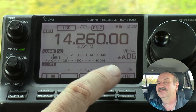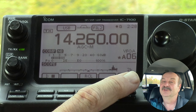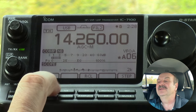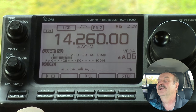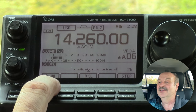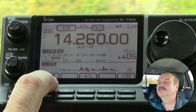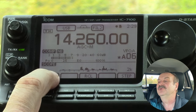At 2kHz you might miss some things in between, although a sideband signal is up to 3kHz wide, so you'll probably get most of the signals. But it's an instant in time, and you can see how dramatically different this display is on each of these sweeps. Because if somebody's mid-syllable while they're talking, you're going to see no signal strength. And then if they're saying a word, you'll see something. And of course, if somebody's calling CQ, by the time you tune to it you may miss it.